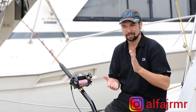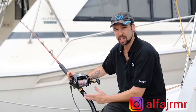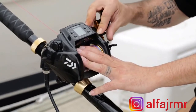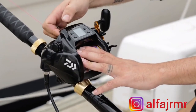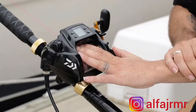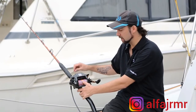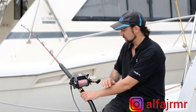Clicking mode again puts me in jigging range mode. I don't use this function very often, but it allows you — if you're in, say, 150 meters of water with a school of fish sitting at 120 meters — to drop to the bottom and set your jigging range from 140 meters to 100 meters, so the jigging function operates only through that depth of water. After setting the jigging function, the last step is to choose whether we want to see line speed on the display. Using the throttle lever, I bring that up and get an on or off option on screen — I'll pick on. I select the mode switch again back to the beginning of the sequence with the zero line display. I let out the line, drop my weight to the bottom, select the reel back into gear, press the jig pickup button on the lower left, and watch my reel go to work.